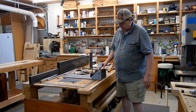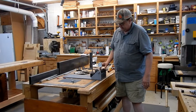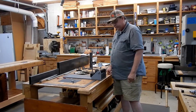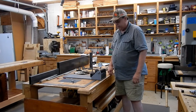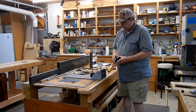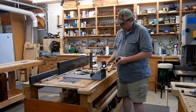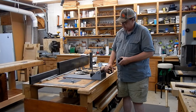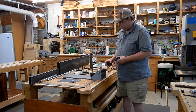It's about as close as you can expect from something that's not machined - an extruded piece of tubing. So that's actually really good; I'm lucky in that regard. I'll put the axle sleeves on here. I'm going to use this to attach the arm width so I don't have to weld on this hub, because it's rather thin and I don't want to distort it.